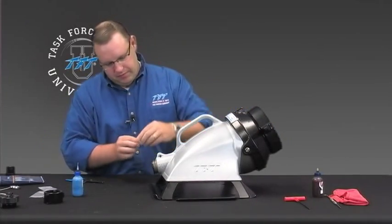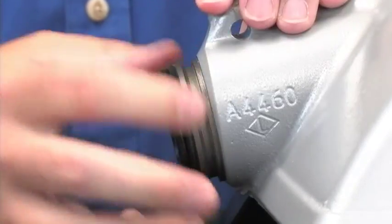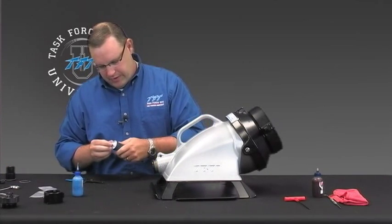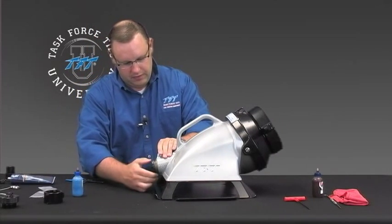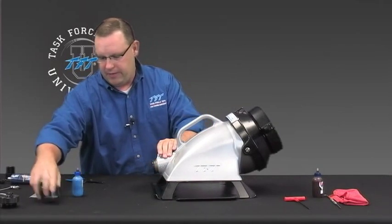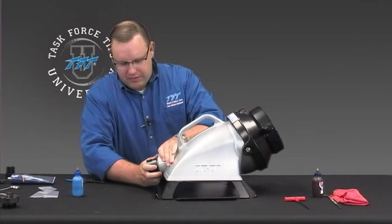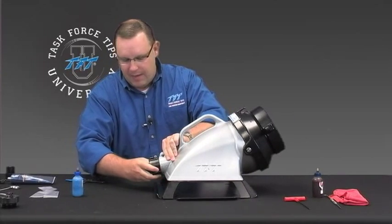Take the other O-ring and put it into the first groove. You'll see that there are two grooves here — one's a ball groove and the other is the groove for the O-ring. Apply a little bit of silicone grease around the outside diameter of that O-ring — nice and lubricated. Now go ahead and take the coupling, slide that over, and make sure that you don't pinch that O-ring and cut it, which would cause a leak. You'll feel it snap when it's in place.